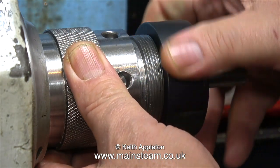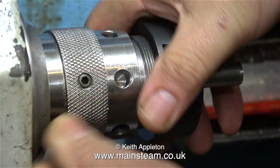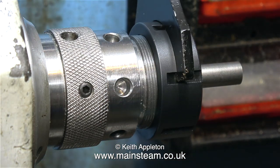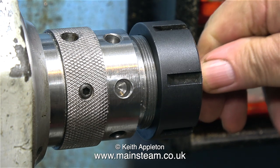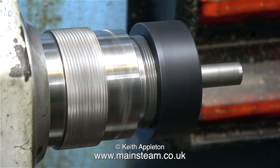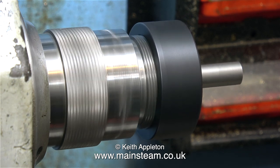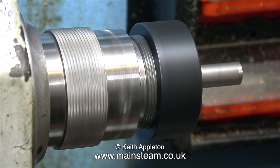A health and safety warning: if you're doing what I'm doing here — tightening the collet chuck by hand — be careful that you don't lacerate the palm of your hand on the piece of steel sticking out of the chuck. I didn't, but I thought it was a good idea to warn you. With the spindle lock button held in place, I've tightened the collar onto the chuck and as you can see everything's running rather well. I've slowed the video down to see what's happening — the chuck is fairly concentric, the ring is okay, but the piece of metal sticking out of the end is moving disproportionately to the other two items.